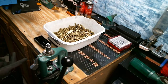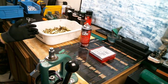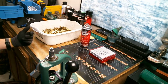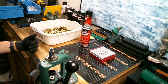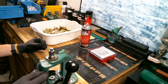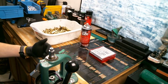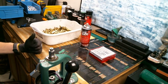We just resized 50 pieces of brass in about three minutes, so it's not too bad for a single stage. There you have it folks - we just resized our 50 pieces of Lake City .223 brass with our Hornady One Shot lube and our Lee resizing die. It's pretty straightforward once you get the hang of it. Just make sure you let all of your alcohol evaporate or you're going to have a bad time with a stuck case. If you use too much lube you'll see some indentations on your neck - that's an indicator of too much lube. Too little lube and you're going to have a stuck case, so a little dent on your shoulder is less troublesome than getting a case stuck in your die. Don't go light on the One Shot and you'll be fine. Thanks for joining us, we'll see you next time.